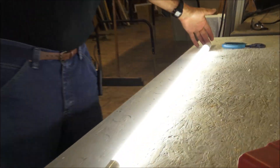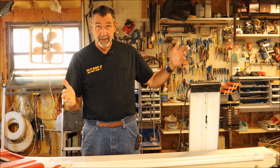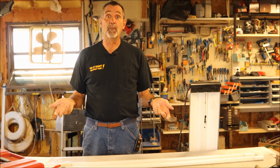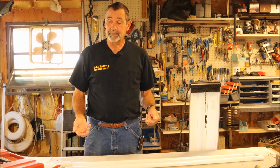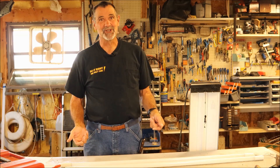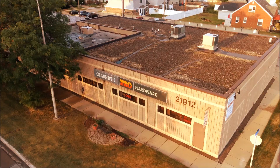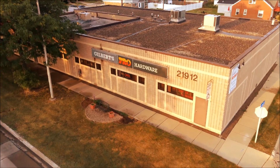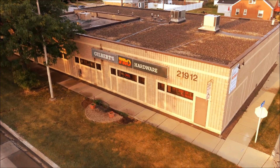There is no wiring at the other end of this bulb — all the power is done at one end, that end is just the dummy. The whole purpose of the video is to show you there are three kinds of bulbs. When you look at your fixture, you figure out whether you can send all the power to one end or you have to go to each end. Then when you buy the bulbs, you won't buy one you can't adapt to your fixture. Knowing that in advance will save you time and effort, and now you're a lot smarter going in. Quick tip LEDs from MrHardware.com. Thank you.